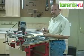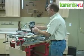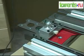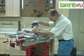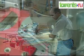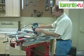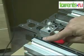For this lettering set, you'll need the optional 1/4 inch stylus. We'll take the stylus and drop it into this first letter and bring it to the far corner. Now we'll plunge the router bit down, and then we can make an adjustment to the position of the board back and forth this direction to line it up at 8 inches. And to adjust the router forward and backwards, we would adjust the template follower here on the back.